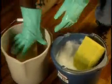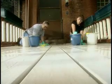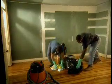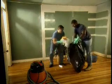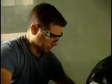Next, you'll need to wash walls, floors, and other hard surfaces in the work area. Wash from the top down and scrub hard. For large projects, wash all surfaces whether you worked on them or not. You'll need two buckets — one with water and detergent and another with clean rinse water. Be sure to rinse well and change your rinse water often. When you finish washing, put all of your dirty rags and mop heads in a heavy-duty plastic bag and seal the bag with duct tape. You may need to double bag the waste to keep the bags from breaking.